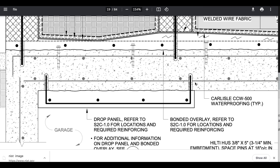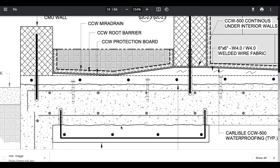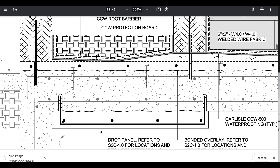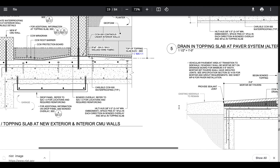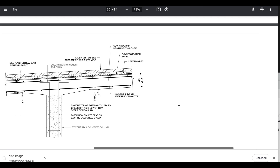Here again is your exterior reinforcement — looks like it's sectional, meaning a small section. You can see how that works. You would think there would be some stress up here they want to address, but I don't see a crack here — seems like it's just extra reinforcement to help in that area. It's by a column — you'd think you would put some more shear links in there at that point. Something would be more of a shear design. I've got other tricks that would reinforce that with my exterior staple method.